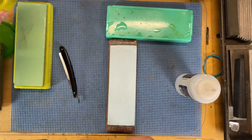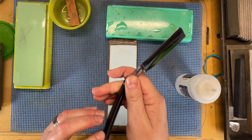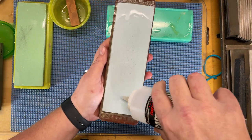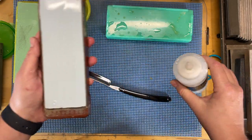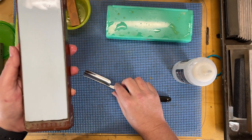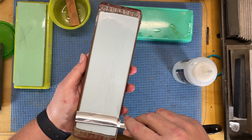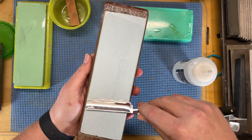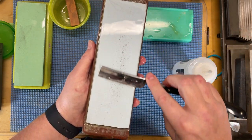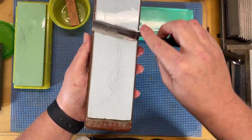So there's nothing else for me to prep on this stone. I'm not going to use the Nagura stone because this stone just got flattened recently and it is not loaded to a point where I would be concerned. So these stones cut really fast. So these might maybe be the exception to the 10 minute rule. Once you start getting up here, you're gonna see me do something: once I hit 5,000 grit, I start doing a few passing or stropping strokes when I finish. So you're not gonna see much of a slurry buildup on this one. So, okay, let's go ahead and go to time lapse.